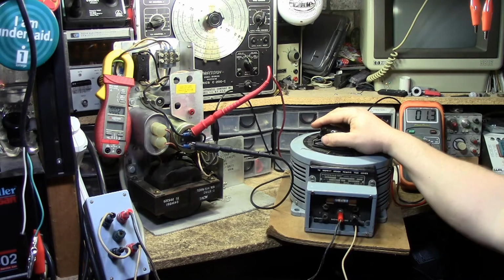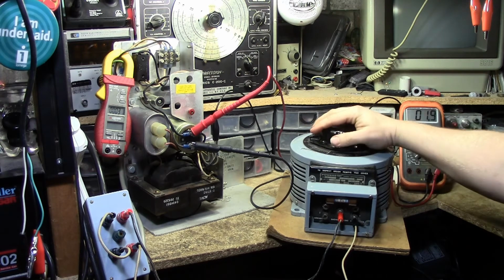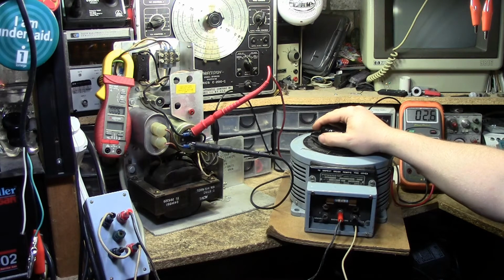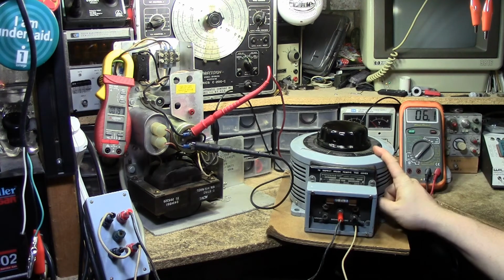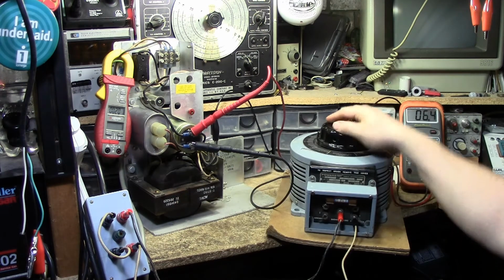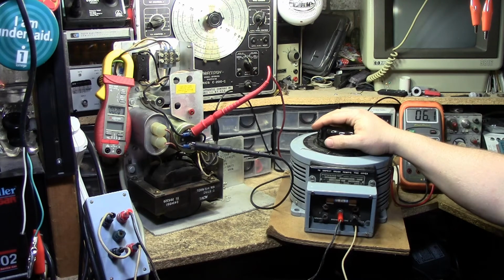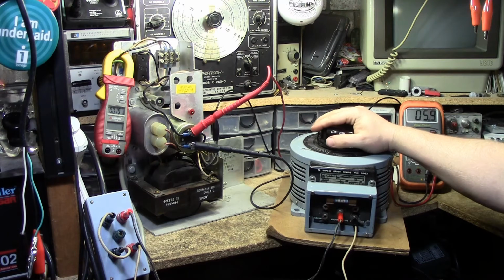And we're still sitting at like 30 milliamps. So there we go, 20%. Going up on 5 volts here. Now I'm going to hear the auto transformer inside of the variac begin to buzz before this one starts to buzz. And we will find at one point at the voltage, the inductance of this transformer will kick in and this one here will stop buzzing. You probably won't hear it though because my microphone is not sensitive enough. Anyway, 7 volts, 8 volts, 9 volts, 10 volts.